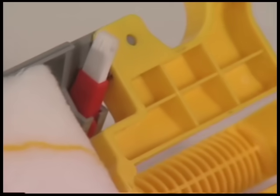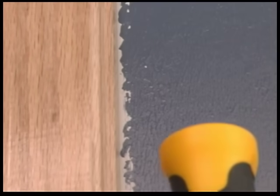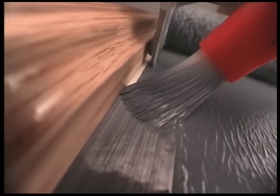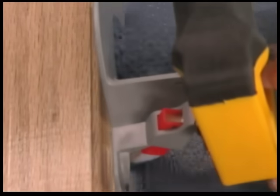Start away from the wall a little bit, and I'm done. Now look how close that is. You can't get anywhere this close with your hand, by using tape, or any other method. It's a roller, and then the brush fits in behind it. The brush is actually what does the final cutting, and that is what allows you to get right up to the edge. Without that brush, this doesn't work. The roller basically puts paint on the wall first, and then the brush comes behind it and moves that paint right up to the edge — so you're never actually putting paint on the brush itself. It makes it a very fast operation. The consistency and results are amazing — very, very accurate, as good as a professional painter.